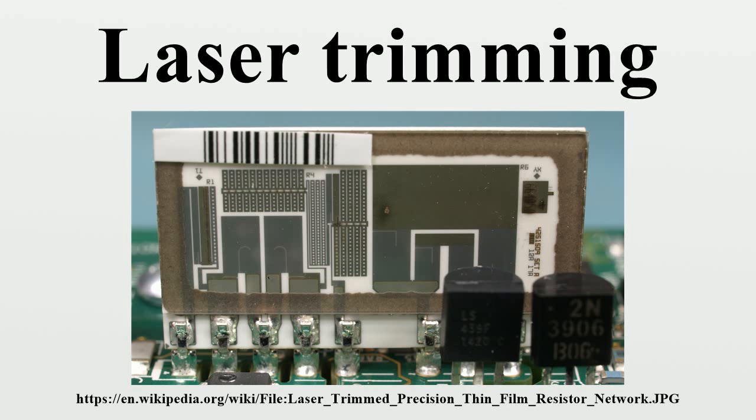The burning operation can be conducted while the circuit is being tested by automatic test equipment, leading to optimum final values for the resistor in the circuit. The resistance value of a film resistor is defined by its geometric dimensions and the resistor material. A lateral cut in the resistor material by the laser narrows or lengthens the current flow path and increases the resistance value.